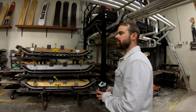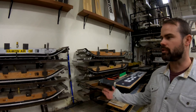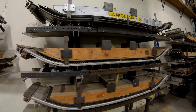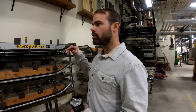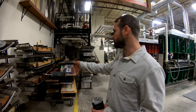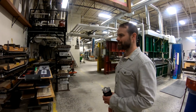We do have a lot of presses that we try to recycle since we're in a prototyping scenario here at Craig's. All of these presses along the wall are ones that we've built up — for example, the Hawk and Hare 5.6. These are all cavities that we've built up over the years, and any time we go to make a new board or a new prototype, the guys here will strip all the parts off, refabricate, remake, and get these to serve the purpose for a new shape. At the factory there is a dedicated press for every single board, but here we've got to be a little more flexible because everything's one-off.